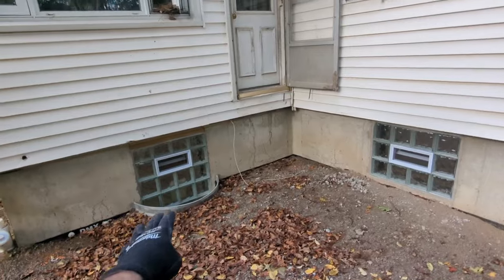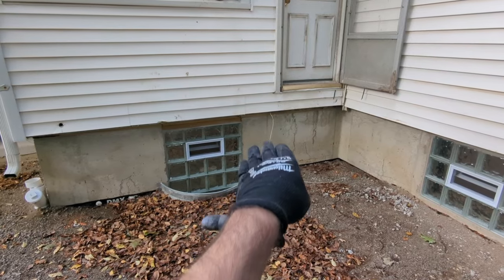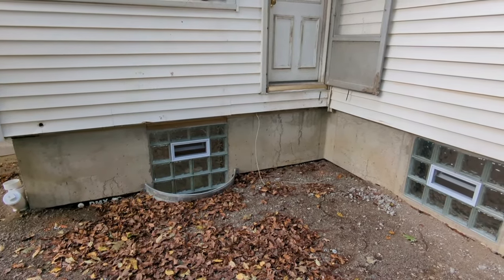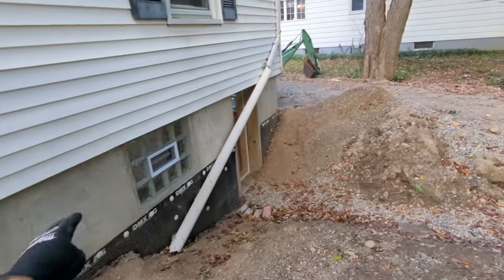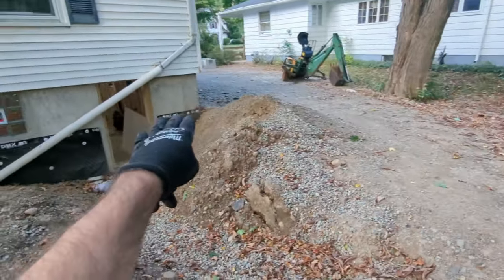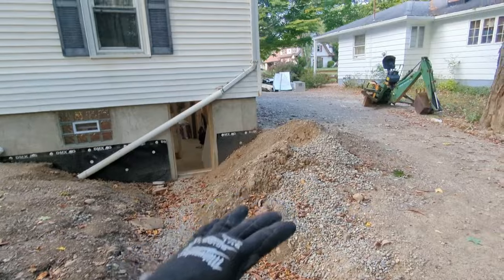This window well's been installed. If we went up that far, I'd have to slap another one on, cut the top edge of that, and try to get another one attached where it isn't obviously an addition, or dig that one out. I don't want to do any of that. So this window would be exposed, and we'd be at the level of the dimple mat. When you stand inside, you can see out down through here. Same will go for the egress window.